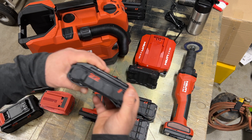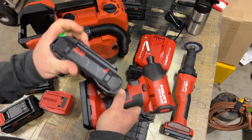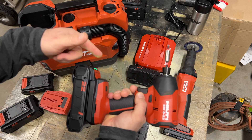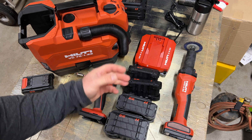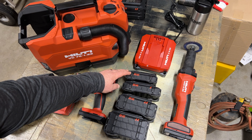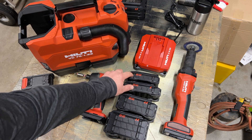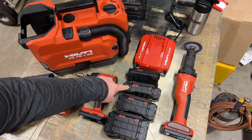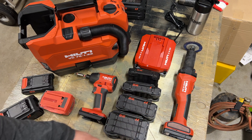This battery would still be a good fit for an impact driver or a drill, and maybe paired with a smaller 3/8 or half-inch impact wrench. You're still relatively lightweight and compact, but you're going to get more runtime, which means more convenience, less charging, and less going back to the tool crib. For screws and fasteners, HVAC work — the small compact 55 watt-hour is great. But for a die grinder, you'd probably look at the 85 watt-hour, the 4 amp-hour battery, because it's a higher-demand or longer-runtime kind of tool.